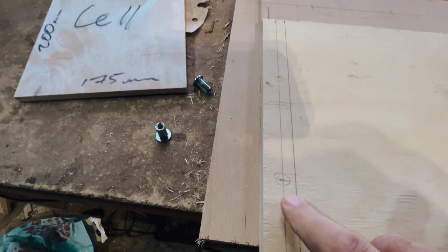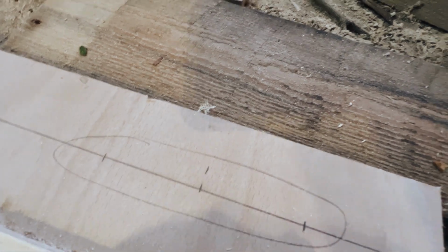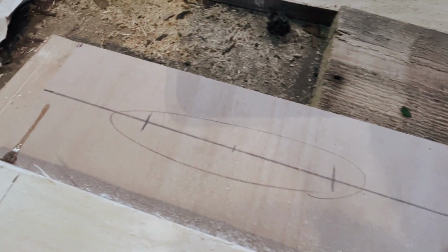And so I've marked out each of the 6 holes that'll be drilled. So 1, 2, 3, 4, 5, 6. Then at the top, if we can see through all the shadows, I've marked, so I'll be drilling a hole there, and then using a Forstner bit, a much bigger hole, and then cut them out for a handle here and similar there. And obviously on this ledge is where we'll put some bars to screw the BMS and the other electrics into.